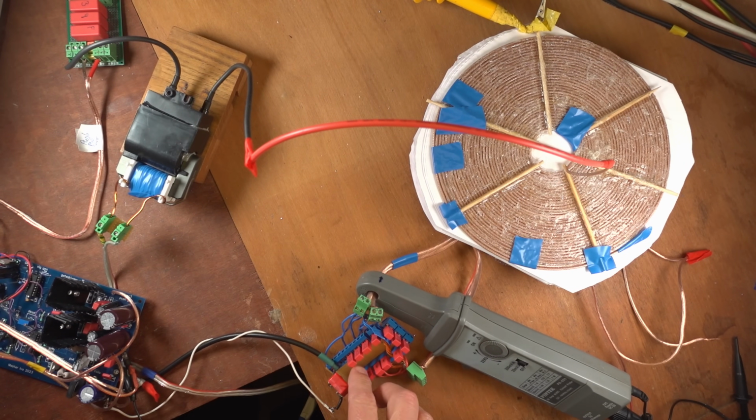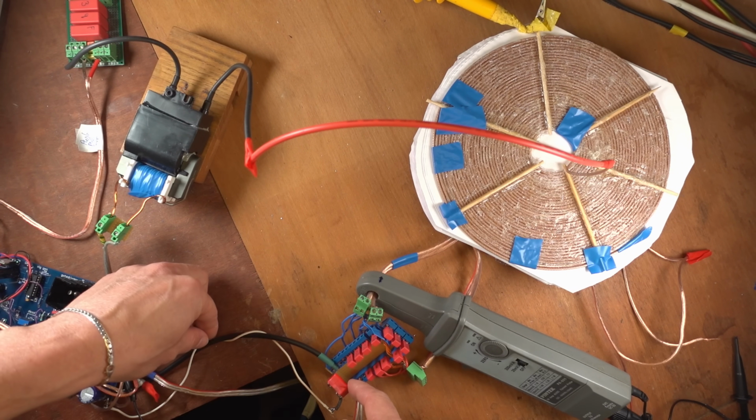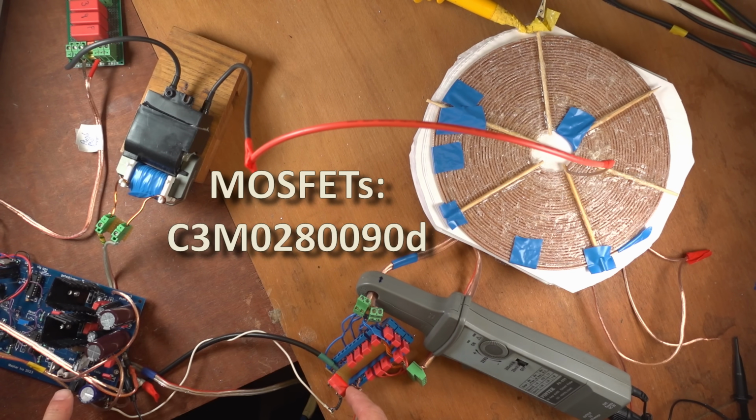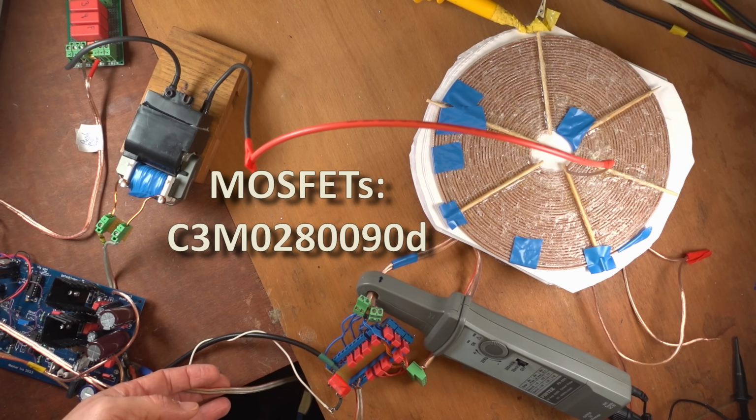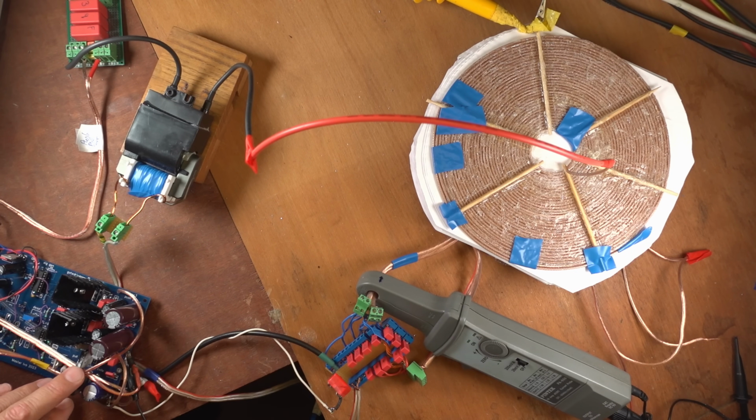And it's connected to the capacitor board. Here's also the charge and discharge capacitor. And here is a coax cable that connects it to the MOSFET for discharging. And here is the cable to the other MOSFET, which is connected to the coil. And the coil itself is connected to the positive voltage supply. So now I'm able to use that coil as a boost converter to charge up this 1 nF capacitor, and with the square wave, when the MOSFET turns off, it charges, and when the MOSFET turns on, it discharges. So these two MOSFETs are simultaneously switching on and off.